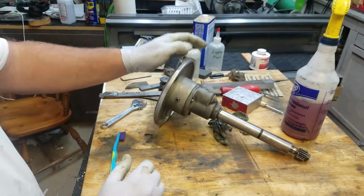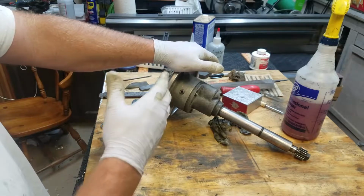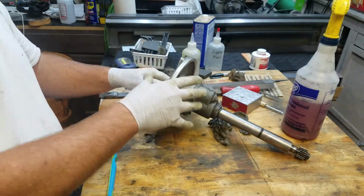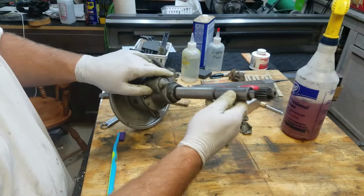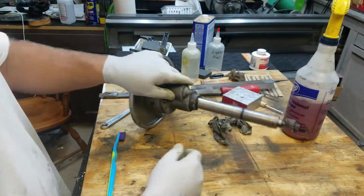So we're looking at the hand wheel for the table feed off the KOLE. We're removing the debris off of it. There's something wrong with the transmission. We're going to pull it apart, take a look, re-lubricate it, get it all cleaned up, get it back on the machine. We already know we're going to have to fix this pinion gear. And we'll carry on from there.